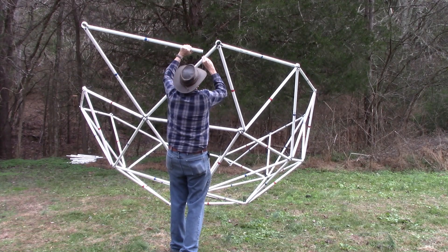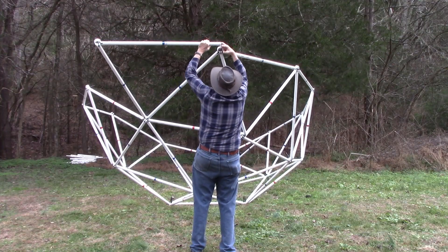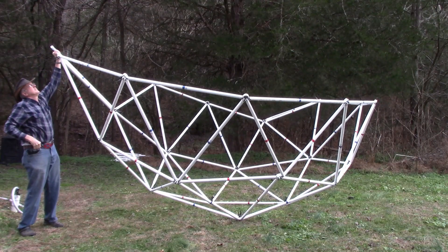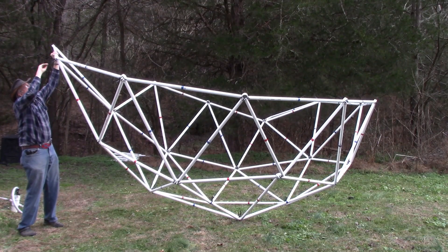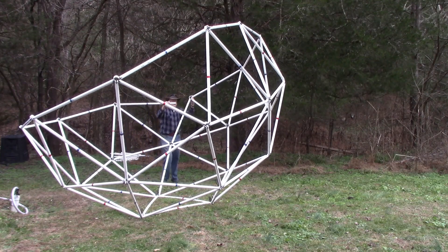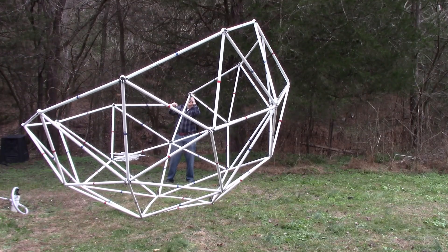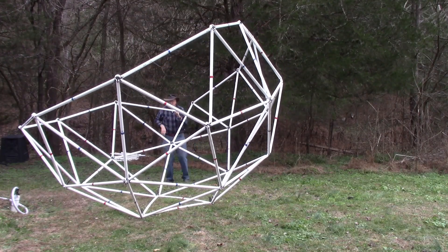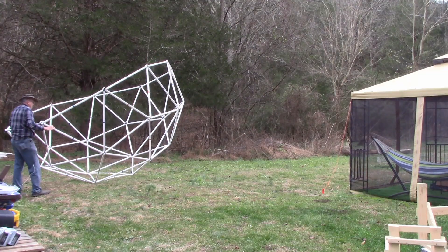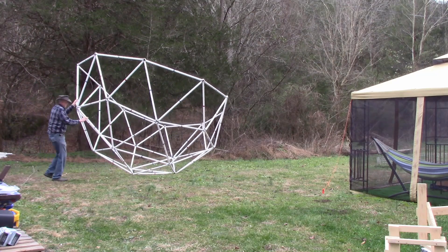You can see that without the locking collars, there is no control or limit to the strut angles, and so this is a very floppy type of dome. I had to build this dome upside down because it is nearly impossible to build a dome like this without locking collars the right side up, as the struts tend to fall over before they can be secured on both ends. You can see how this dome wobbles when stress is put on it, and when I try to turn the dome over, it nearly collapses on itself.